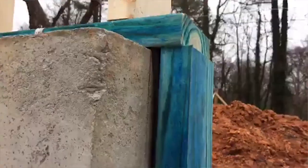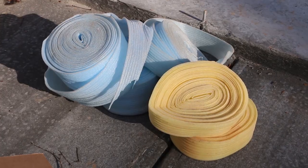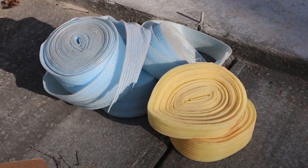We're upgrading the impermeability for moisture and air of our building envelope. One of the most important systems in a home is often the one that's overlooked — which is the exterior, and just how well your building's exterior keeps moisture and air out. One of the weakest spots in a wall system is actually the space between the foundation and the base plate.